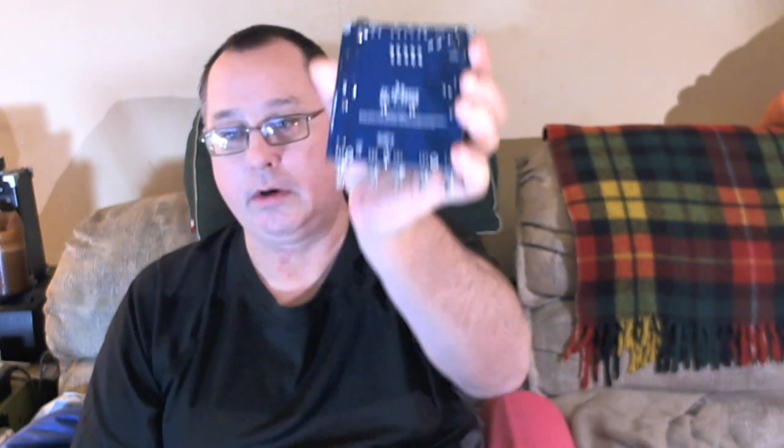It sits right next to the treble control. And it's actually labeled very clearly, all frequencies are normal, okay? So I'm guessing it's a shelf where when you have it in the normal position, which is up, it only, when you turn that knob down, it only affects the high-end frequencies of the tone.